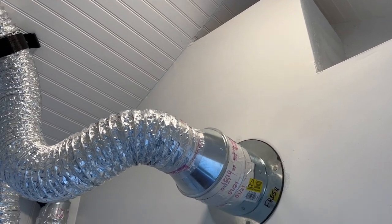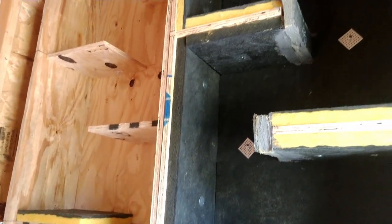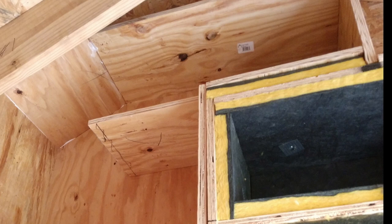Now that we've covered the design, I want to show you more details of the actual build process — because like anything you build, there's always some art and improvisation. From the original design, we built it exactly like Rod had done, but to fit it into the extra shed area we had to tweak his plans a bit. We extended the box handling exhaust air to go up and over the other box. You can customize this for your own studio, just keep the general dimensions the same so air can flow through, slow down, and get quieted by the insulation inside.